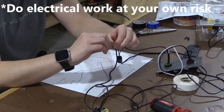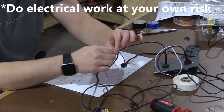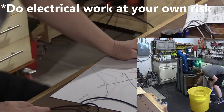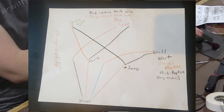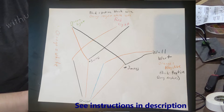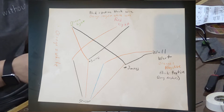This is a red light, green light system. His system had a big strobe alarm light, but I don't want to be distracted — I just want to be notified. Especially because I'm going to be using this for my bandsaw, and I don't want something flashing out of the corner of my eye and cause an injury. So I chose two small LED lights. I like that there's a green light too, not just a red light, because this lets you know it's working — otherwise you could go months not realizing it wasn't functioning and then you'd be clogging up your filter. The sensor is a Banner sensor; I'll put the exact model number — you can find them on eBay, they run about $25 to $30. The lights were about $5 and the wall wart was maybe $10 or $11, so for really inexpensive you can get a really great sensor.